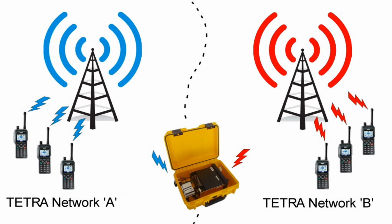And the base radio itself. That's the part that actually delivers the digital radio capabilities. It uses voice compression and something called time division multiplexing, TDM, which is just a clever way to let multiple conversations share one radio channel efficiently. Very reliable. Wow, okay. Much more going on under the hood than you'd think.